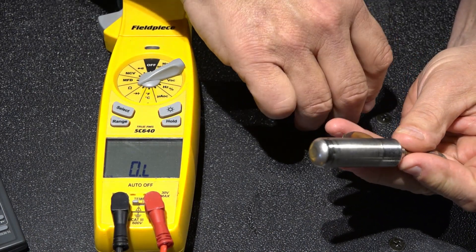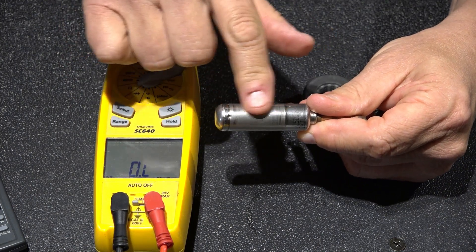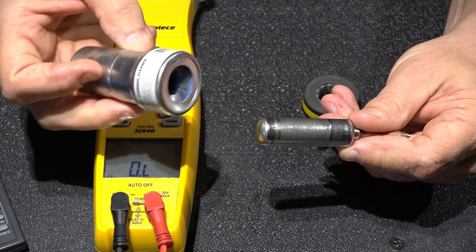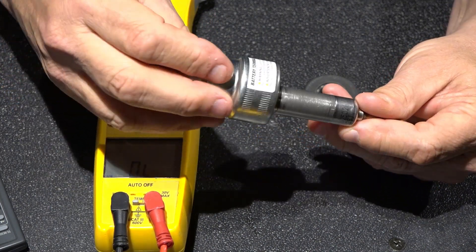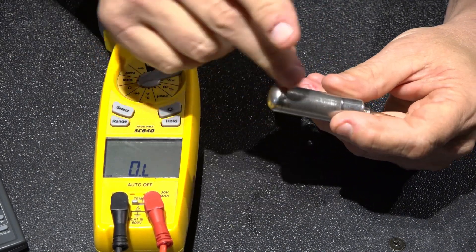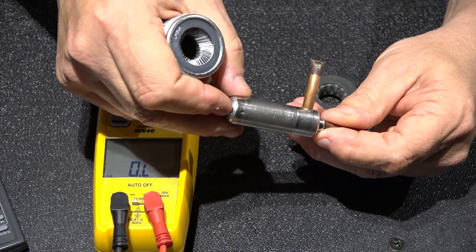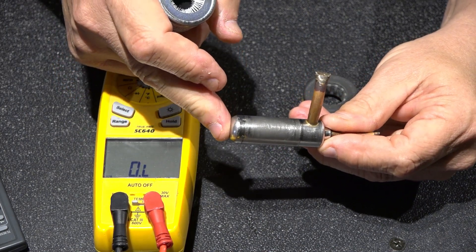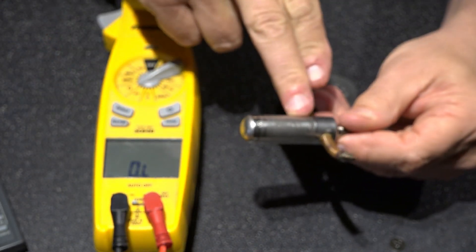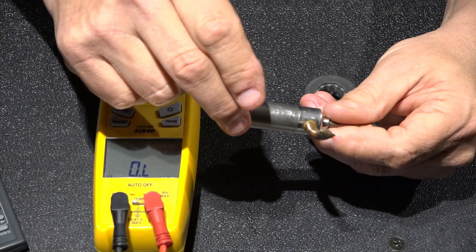During a PM I need to make sure the surface here has been cleaned up. One of the tools I can use besides sand cloth is a top post battery brush. I can slide this over the top, turn it, and it polishes up the surface and removes any type of corrosion - especially if you're in coastal areas where you've got a lot of salt water spray in the air. It'll corrode this up pretty good and you'll get a lot of white oxidation built up on there.